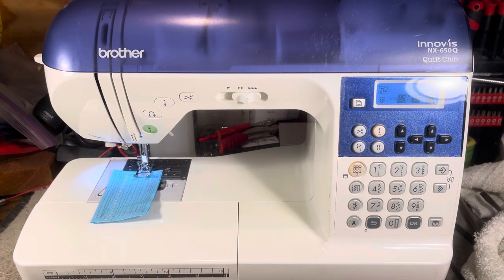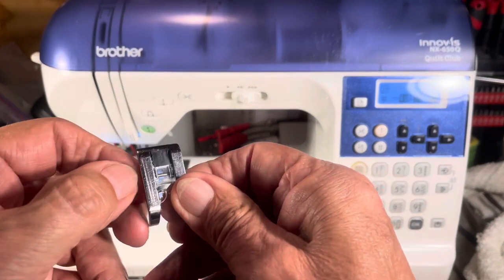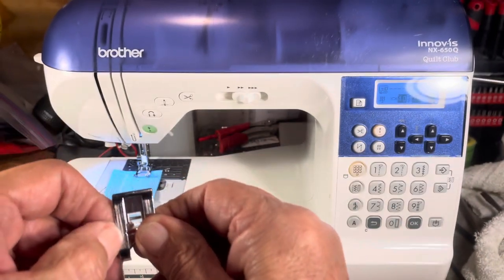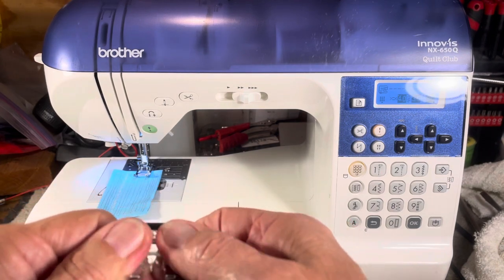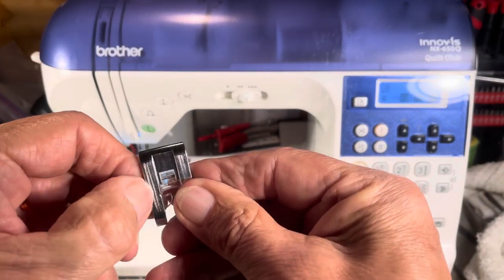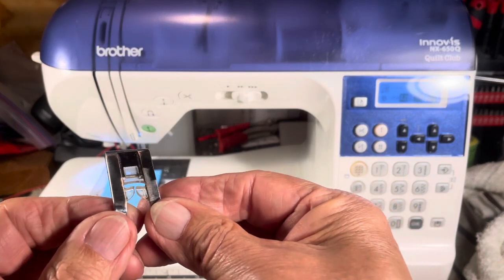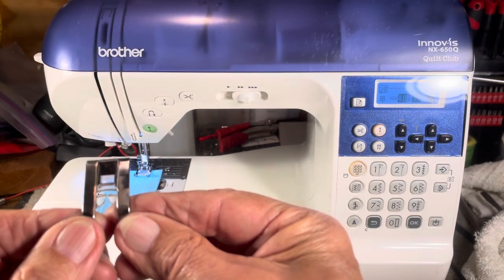They didn't look underneath to check. If your story is that you've worn the feeders down and you replace them, it only stands to reason: what did they wear down against? The bottom of the presser foot. Flip it over and it's pretty obvious — it's cut grooves in there, and those grooves are deep. I can catch my nail in them. When you go to sew, that's hanging up the fabric and sending it crooked, even though you've got new feeders which you didn't need. I have drawers full of feeders. To wear down a feeder with a sharp hardened point — I've never seen that happen in 50 years.